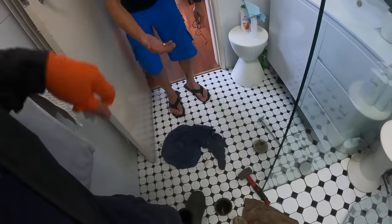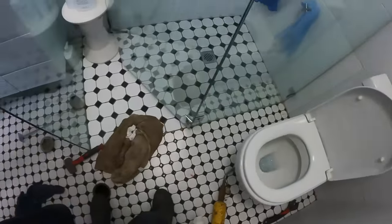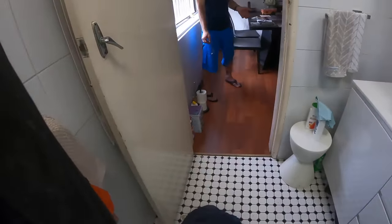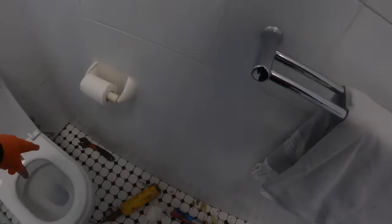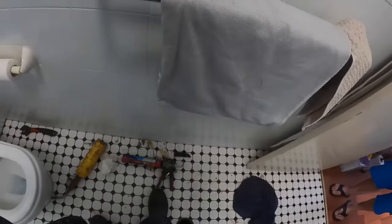She goes, why is it coming up from the drain? I said, it's not coming up from the drain. It's coming from the back of the pan. Yep, you weren't going crazy, Ollie. In the end, they nearly convinced me because everyone was saying, no. Well, what was happening is it was backing up from those roots, then it was coming out the back of the pan and dribbling through to here. Well, the water goes the least way of resistance anywhere.